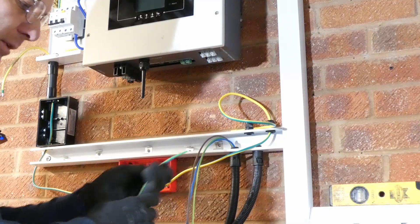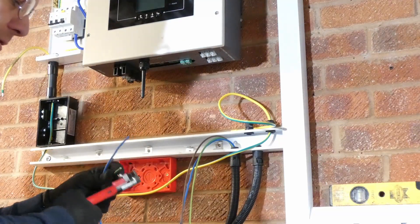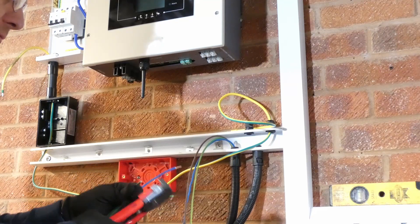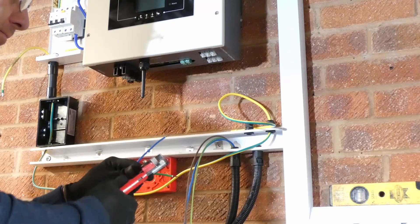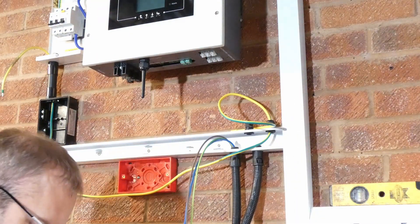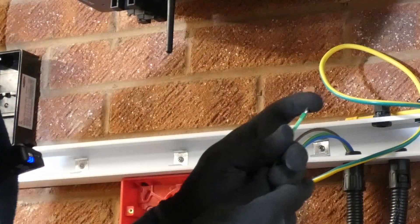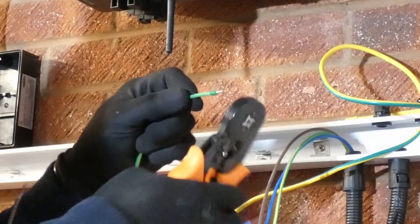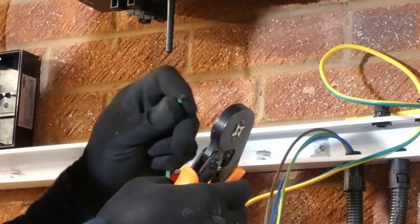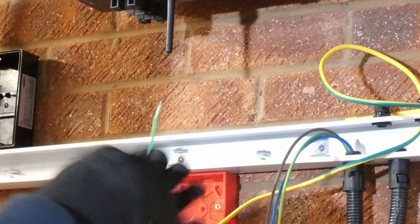I also need to make sure I leave some slack on the back of these cables. I'm going to slide the conduit on and off. These are very good little wire strippers. Because these cables are multi-cored, I'm actually going to put some ferrules on the end of the connections — they simply slide over the end. Then an unusual crimping tool is used which crops and squashes it into a square shape, and then that's ready to go into the terminals.